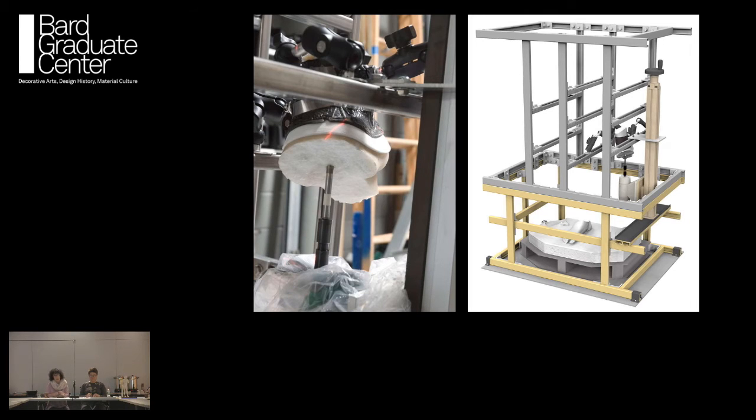First, the drill was placed on the lower spindle of the lathe, and a hole was drilled down into the base. Then it was moved to the upper spindle, and a hole was drilled up into the ankle fragment, which is what's illustrated here. And that allowed us to drill perfectly aligned holes. And if you have a perfectly aligned hole, you need the smallest possible hole. You don't have to keep enlarging it. If you do this by hand, you tend to enlarge the hole in several attempts, and you lose more and more material.